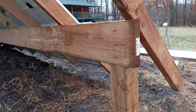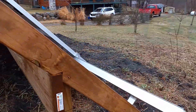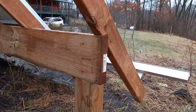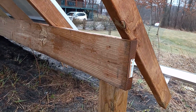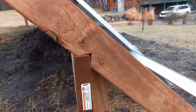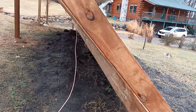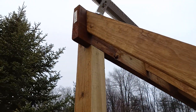I did all lumber construction here. I have 4x4s as posts, and I notched the posts so the beams sit on the posts as opposed to lagging them in. Then I could just use some deck screws, which would be plenty of strength. I also did a little bird's mouth on here so the weight is actually on the 2x4. Same deal up top — hope you can see it.